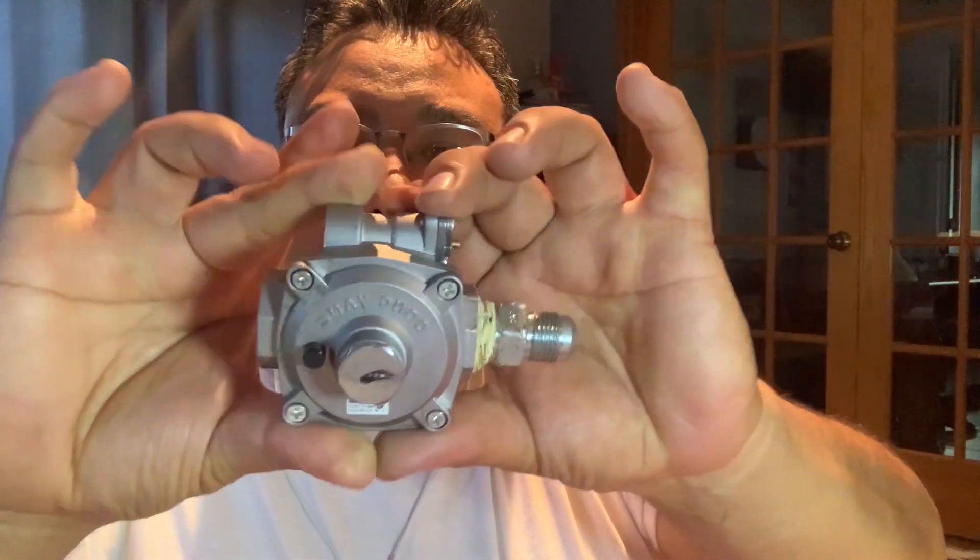I really want to focus on how much pipe dope — or whatever product you want to use — how much of it should you really put on, and how tight should it be. This is just ridiculous. This thing was so tight that the aluminum or copper lines that came out of here and went into the stove were all bent up and kinked, and the customer was wondering why they had a gas problem. I hope this was not a plumber or someone with experience.